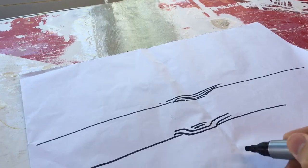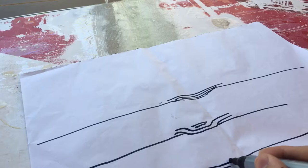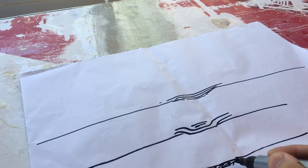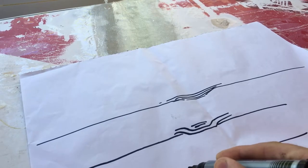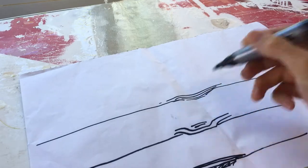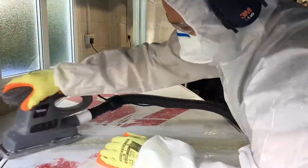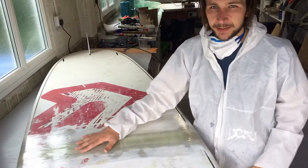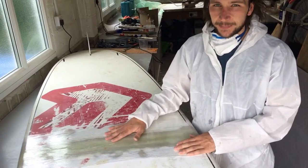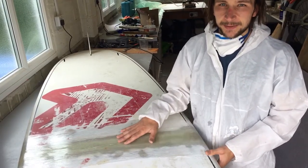I've tried to fill that trough in afterwards with some resin. It would have been a lot better if I'd brought the surface up to being level first using some polystyrene, then filled over with a feather edge, done some level fills, and then gone back to sand it down. The reason it looks like a mess is because I filled this area in fiberglass. It's not a very neat job right now, but when I take the clean film off and sand it back I'll be able to level it off and that'll make it look good — and it's structurally sound right now.